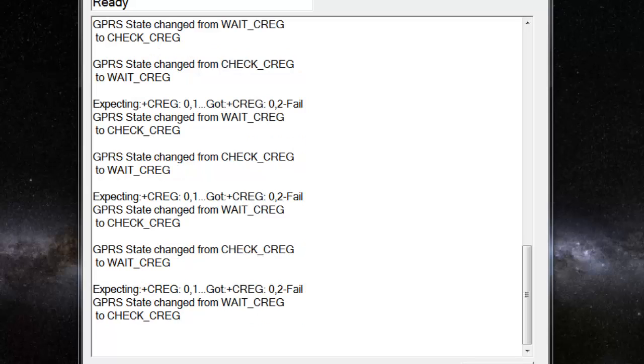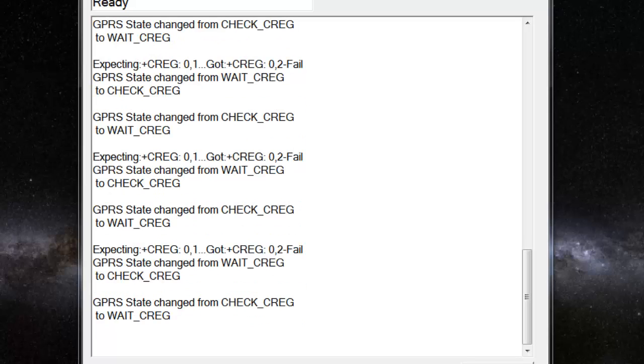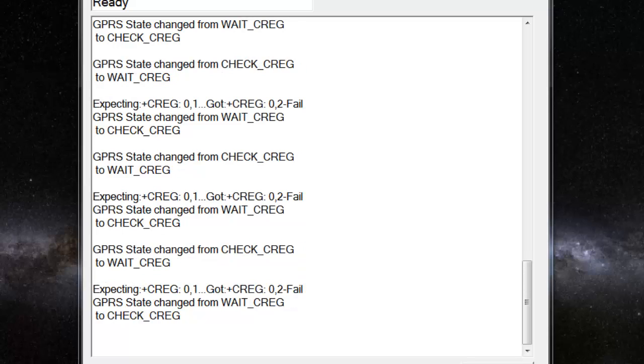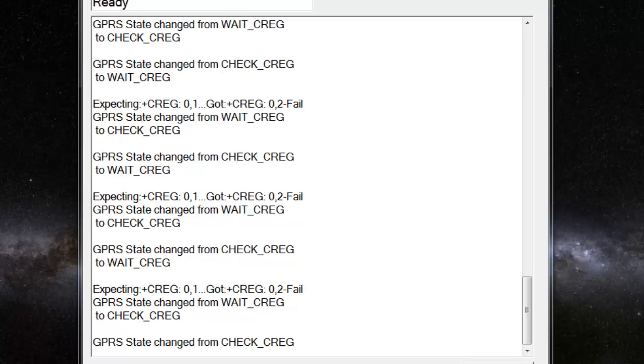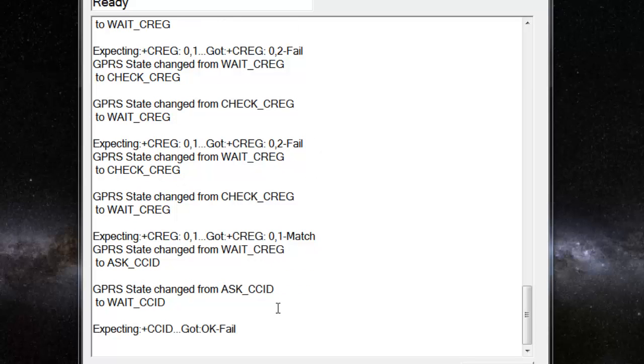And again, I'll plug that antenna back in over here, and a little bit of poking around, and click. And what you'll see, in the fullness of time, give it a few seconds. Well, see, it's found a cell tower now, and it's going to connect. So they're the two. That's what it looks like when you've either got a bad SIM card or a faulty antenna. It gets stuck at this trying to register on the network stage.